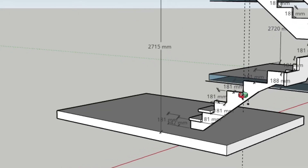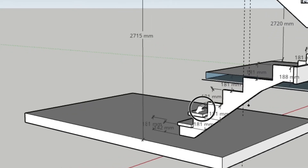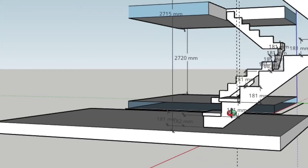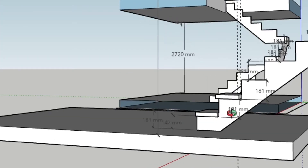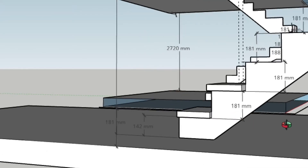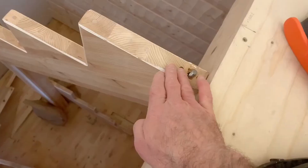What I did is I took all the accurate measurements of the stringers, built it in the model and then adjusted it. I've worked out the new levels I'm going to cut these stringers down to. Initially I thought I would bring the stair up, but no, that's a stupid idea — I'm not doing that.